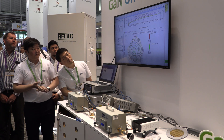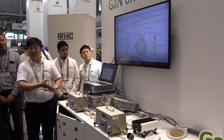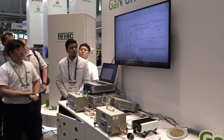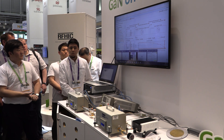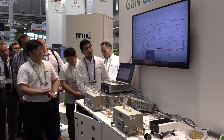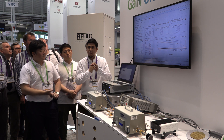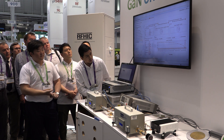We will show you some of the power sheets and the contours. Note that the transistor itself is not internally matched — it is at the center position. For the live demo, we did the optimum impedance, so it's one single impedance point. We also have a previous measurement where we measured multiple impedances over a small section, and we have the contours for that, so let me go ahead and pull that up.